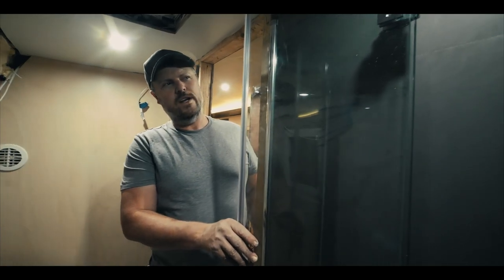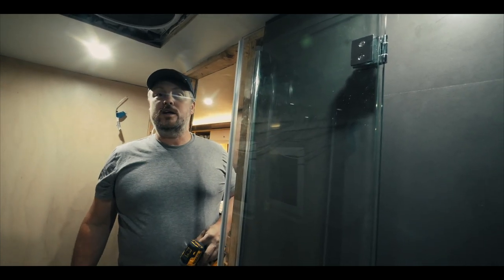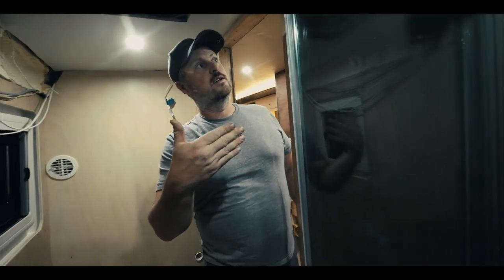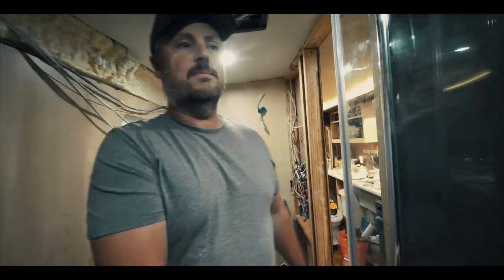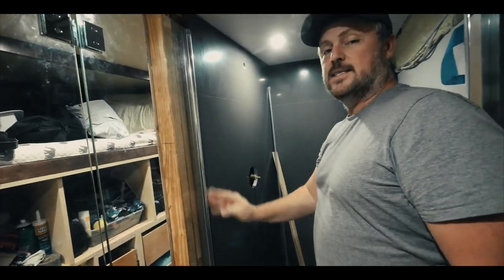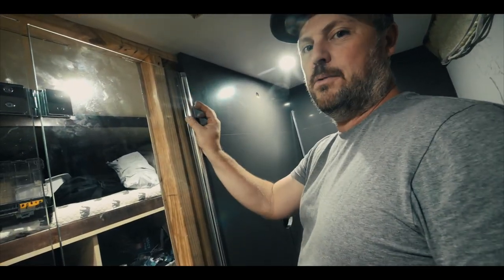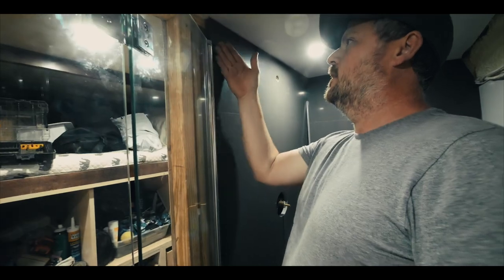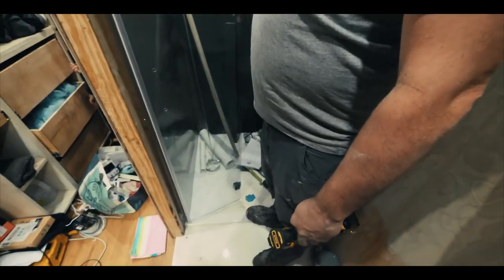This is a 34-inch bifold; we had to be very creative with how we could use it. We did not have the amount of space here that we needed, so we are literally installing the door track inside the wall. The hinge is literally flush with our quartz - it actually looks really good. Normally you'd have a track that sticks out and then your hinge sticks out past it, but this is flush. The door has a magnetic strip and it will just open up and attach right in.